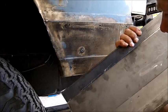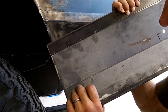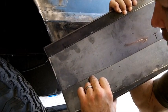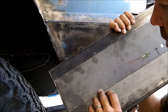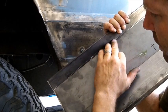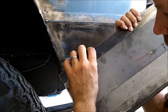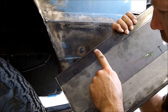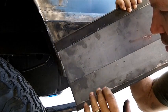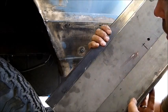And it'd be a little bit tricky. This one I don't see too much problem with, because when I cut this and bent it, the line joined back up again. So I don't expect it to change the angle too much. Where I got a line here, you start welding this, it could actually draw this angle different. So what we're going to do is weld a scrap piece of metal from here to hold it. You have to do the same on this bottom one. Okay, and we'll start with little welds and check everything, and then we'll go from there.